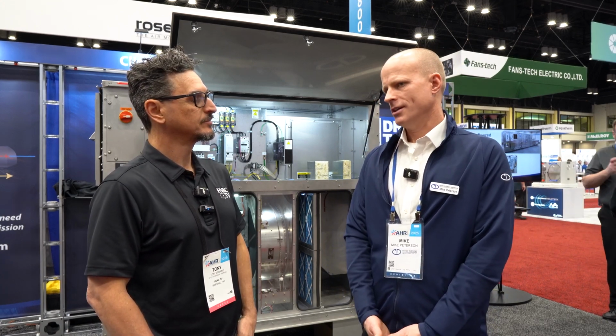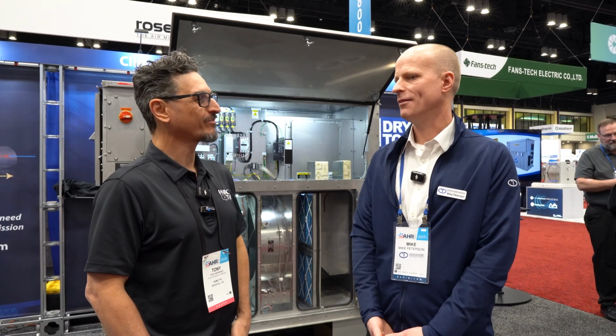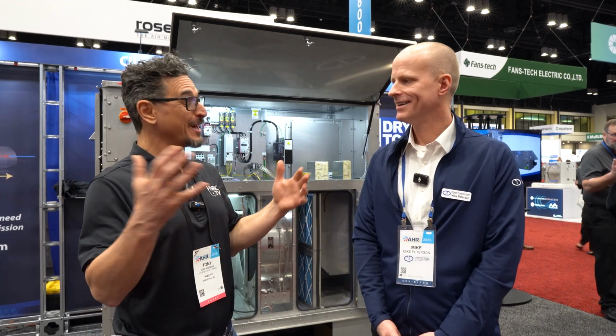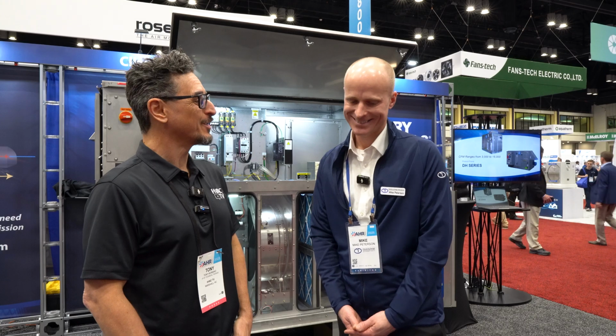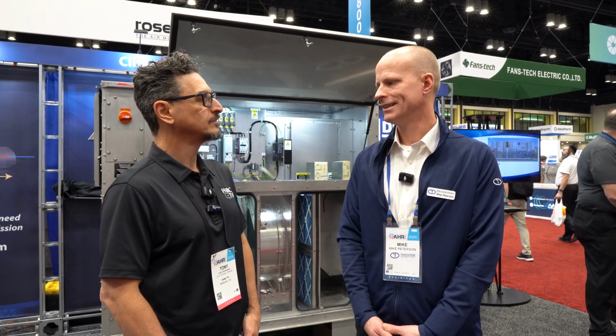And what type of heat is typically used on the regen side? Well, that's changing. Historically, I would say gas was probably our most common reactivation, direct fired gas, because it's got a lot of BTUs. That's right, it's easy. You don't need a big wire and upgrade the electrical infrastructure. I'm teasing a little bit because we face decarbonization and electrification, which in some cases makes a little bit of sense. In some cases, you're going to scratch your head, because the amount of kW required to regen is immense, especially if you're trying to retrofit something. So anyway, it was usually gas; electric is becoming more of a thing. We've done steam and other heat sources as well, but those are the most common.